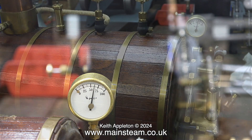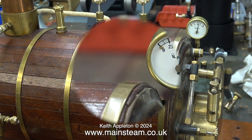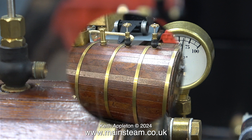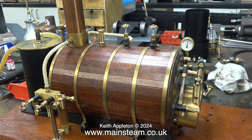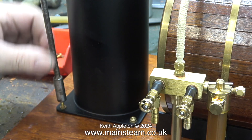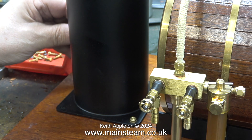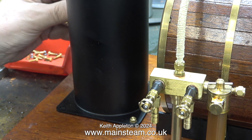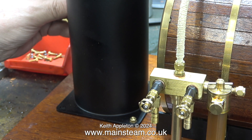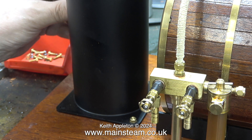The pressure holding at sixty psi is a good sign, but this is a large boiler with quite a lot of metal so it stays hot for a while. Nothing is connected to dissipate the steam so I just had to wait. The water gauge blowdown valve is still leaking a very small amount of steam — I'm definitely going to pipe this into the water pot where the gas canister sits, not to heat the water but just to keep it aired.